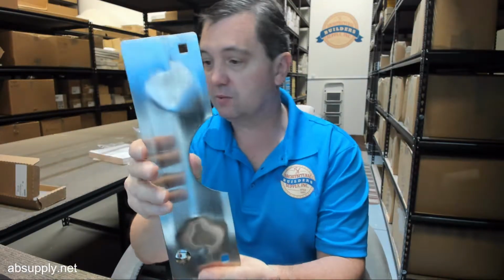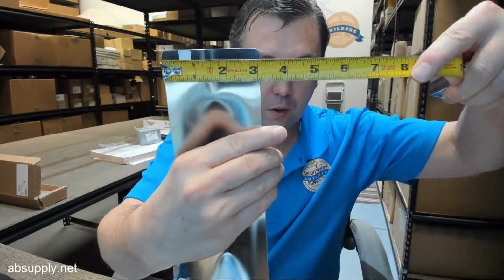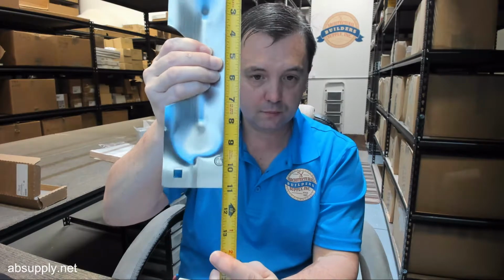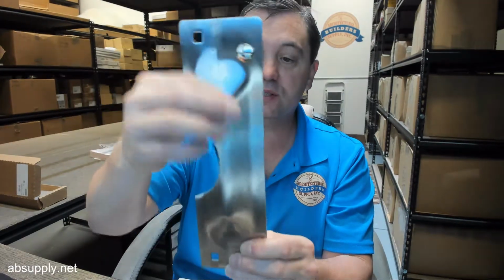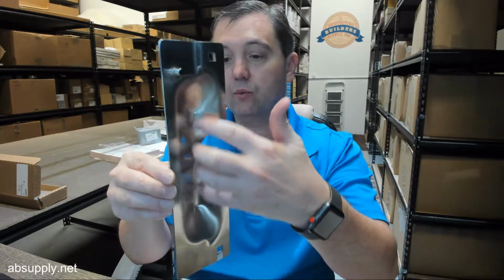Okay. Let's go over some dimensional properties. Rockwood has this 3 inch by 11. Okay, that is indeed correct. This is intended for installation to cover the latch area and the strike lip area of your exit device, deterring break-in. This raised feature to the latch protector allows room for the lip of the strike to reside within, so that you don't have to alter the strike.